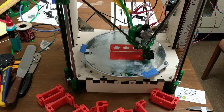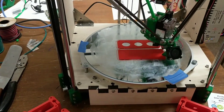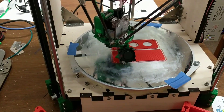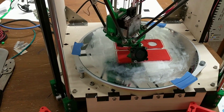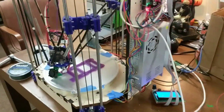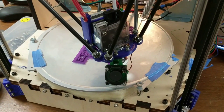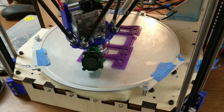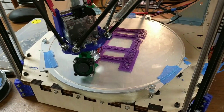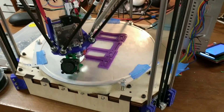We're running a Mark III RepRap-style 260 millimeter heated bed. On this one we have a 10-inch mirror, which works very nicely as the flat surface. On the other one I had bought borosilicate glass, which costs about five to ten times as much as the mirror. I'm going to use mirrors in the future because I see no difference in performance — it's only running to 60 to 65 degrees, so the mirror isn't a problem at those temperatures.